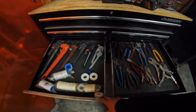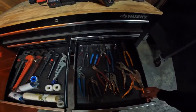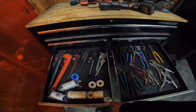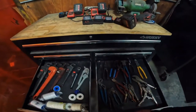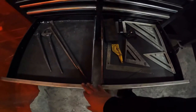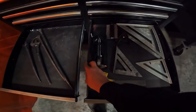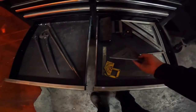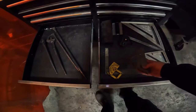In the next row I keep all my pipe wrenches and all my pipe tape. I also keep all of my pliers, Channellock, different kinds of channel locks and vice grips. For me, I work on a lot of air and gas lines so having a lot of pipe wrenches definitely comes in handy. I would recommend getting an assortment of these things — all of these do come in handy, and at least having one of each would definitely be preferred walking onto any sort of job site. For the last drawer I'll show you: I have all of my spuds and my sleever bars so I can line up bolts and different holes. I also have all of my squares and my degree finders, and I also have a set of calipers. One suggestion I give for squares — keep buying metal ones. There are plastic squares, but a lot of these plastic pieces will just get destroyed over time. You might as well spend the money and buy a metal one that's going to last years to come instead of buying cheap plastic.